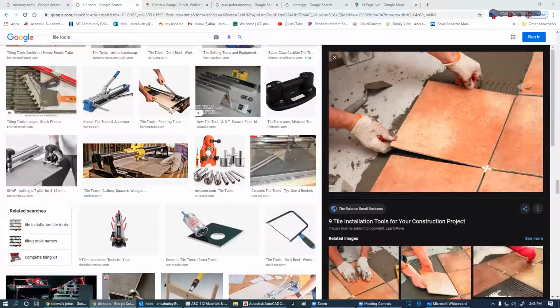So here's my tile on my counter, and I have the minimal joint. These are butted up together on the bottom, and it gives just a very small joint there. And this joint is unsanded. There's no sand in this. And I seal it probably every 6 months or so, so that I get no bacteria on here. This is a ceramic tile, so the surface of this is very fine porous. Super fine. And then we clean it daily with Clorox wipes or something.